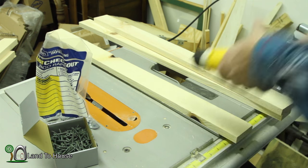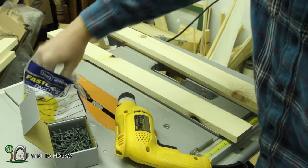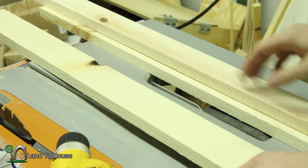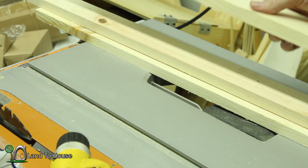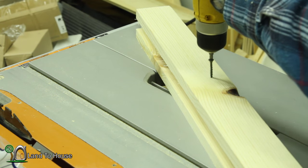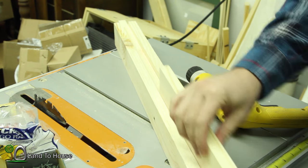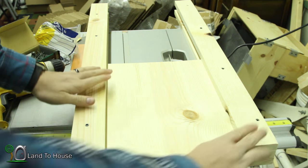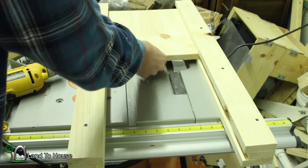I'll do the same thing up top and put a few screws in between, making sure it's nice and squared off. On the flip side, it's not important to put a washer because that one washer's thickness is enough to make this slide easily. So with this one I'm just going to plop the next board on top, line it up, and screw it together. As you can see, we've made a track that the door is able to slide up and down on with plenty of give, and it's not going to come out sideways. Both runners are done and I've got the door in here just to show an example of how it's going to operate — very smooth.